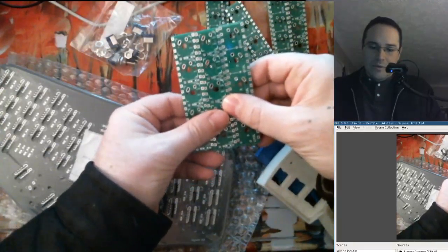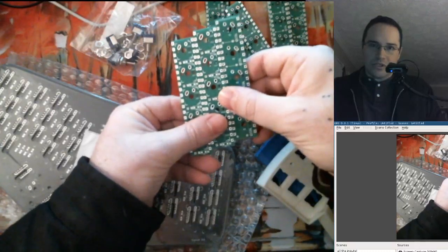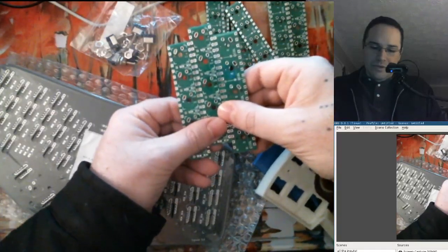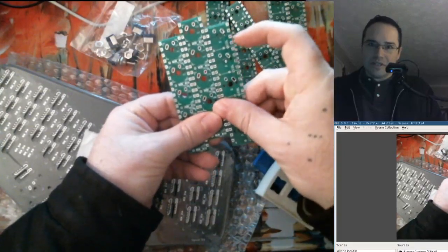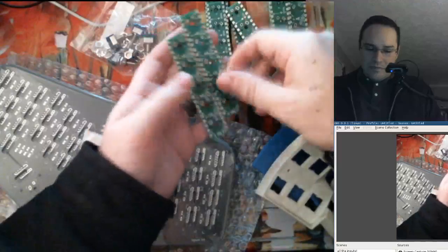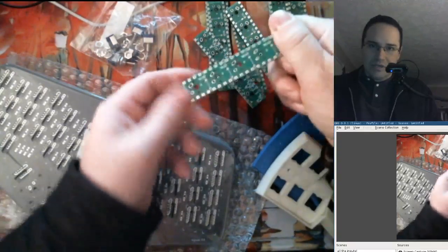But you can also do that, as long as you solder the bridges across for the same spot, you still make the same connection. You can even go like this if you want. As long as you solder the bridges across, you've got your same connection on this side, so you don't have to run wires all over it. And that's pretty neat. This has 5 of them. I haven't figured out the V scoring or how that's going to work out, but I would like it so that you could snap off this bottom one in case you wanted just 4.